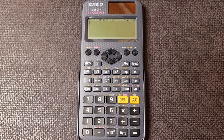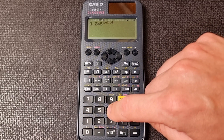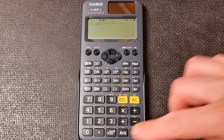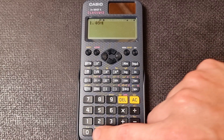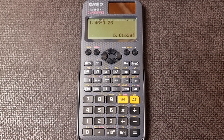In the calculator it would look like this: 0.2 times 5, then press the power button, then log, then the long length of my bench which is 1.46 metres. Pro tip: don't forget to close the bracket or it won't work. Hitting equals gets us 0.26. This value is in metres and is simply the minimum spacing between points for measuring. Then we take that value and divide the length by it to find how many points we'll be measuring at. So 1.46 divided by 0.26 gives us 5.62 points of measurement.